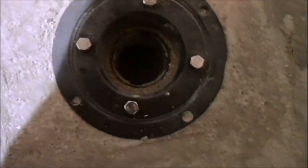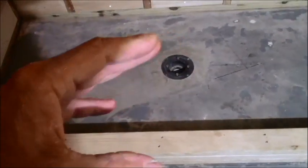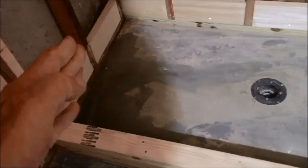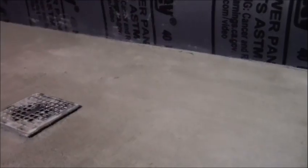When I first came in, I screeded out some thin set on top of the concrete that I poured yesterday, which looks very, very nice and very dry actually. But I got this smoothed out really nice and even, and all the way up around the drain very nicely. So the symmetry is perfect from front to back, left to right, which is the whole point of going through all that. And we're good to go. And putting the pan liner in is next. Day 3 was actually pouring the pan, and because through the weekend I wasn't here, it is set up for a solid 2 days.